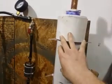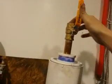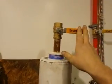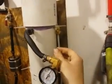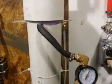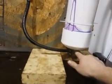Air pressure comes up and goes into the pressure vessel. I have a main ball valve up top for filling — using a larger size so less spillage. I can secure that when charging the system to build pressure. Over here I have a clear line that I use as a little level indicator, so I can tell when it's depleted and I need to fill it. It goes down to the line I tapped in at the bottom for fuel pickup.